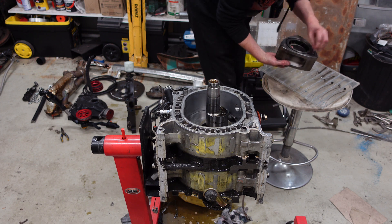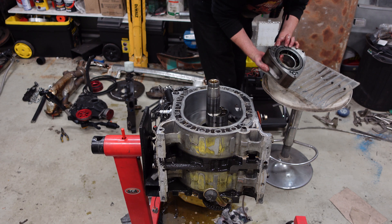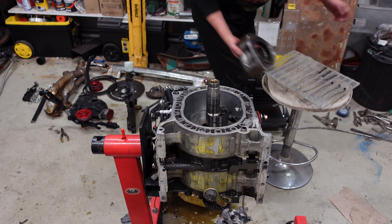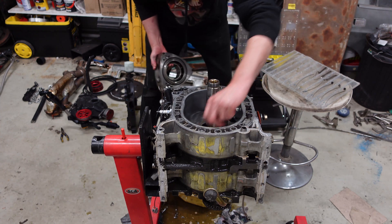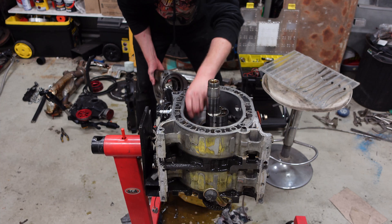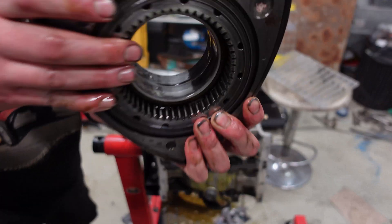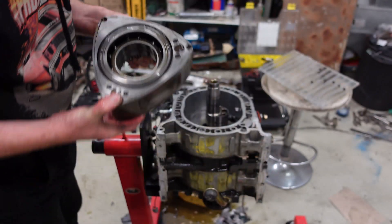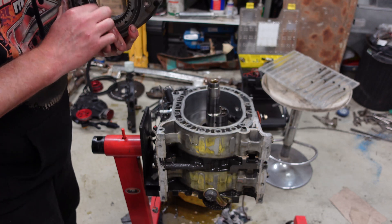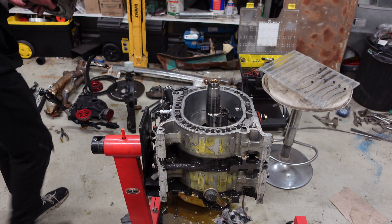That's all complete — it's beautiful. This side looks good as well. Mainly what I'm checking for here is to see if anything's jammed in, which it definitely is not. If it starts and runs, you generally ain't got no problem. Quick look at the rotors — they look fine. It had brand new bearings in it, so you can see the bearing material. That babbitt coating is still pretty heavily on there. There's barely any wear on it — that's really good.